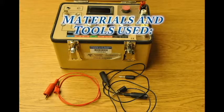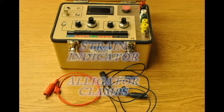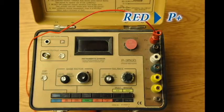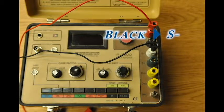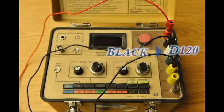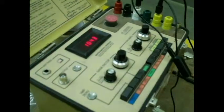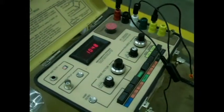Clamp to the shielded wire with a blue stripe. Connect the black alligator clamps to the other two shielded wires in any configuration. If the blue stripe shielded wire is not connected to the P-plus spot, the strain gauge will not work.